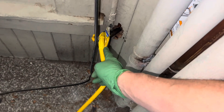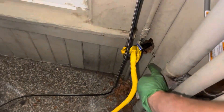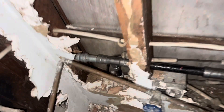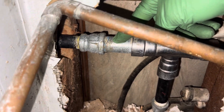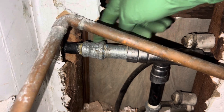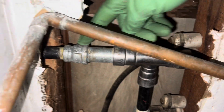The whole idea was to get gas out here while they're remodeling — they're putting in their dryer. We go from this point right here, we have black iron. Is that black iron? Is that copper? Yeah, that's black iron, just had a different color to it, almost brass. Look what we have here — we have galvanized. We don't use galvanized in our state on gas. So they threw some iron in here with a coupling to a T.